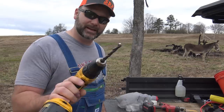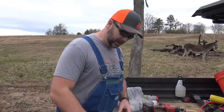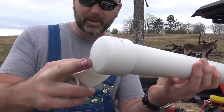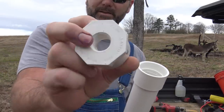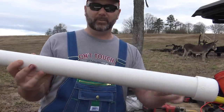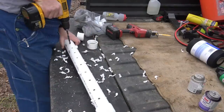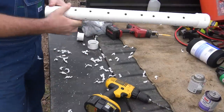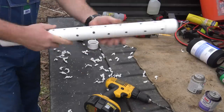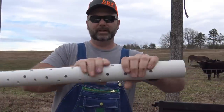We're going to take around a half-inch drill bit — might be a 9/16ths — and we're just going to start drilling. We're going to drill probably 100 holes in this piece of PVC, then put an end cap on the end. We've got a coupling, and then an adapter that goes down to a threaded three-quarter inch pipe. This will have holes all through it, then we're going to wrap it with screen and zip tie it. After drilling all the holes, rub it down and make sure there are no burrs to catch the screen.